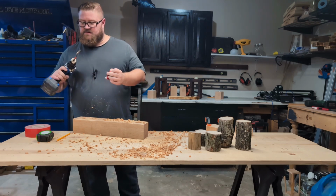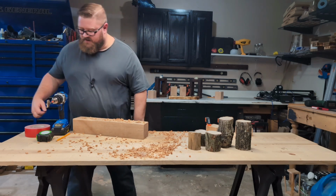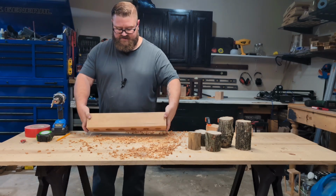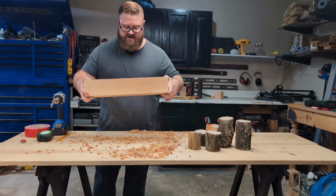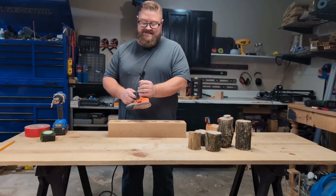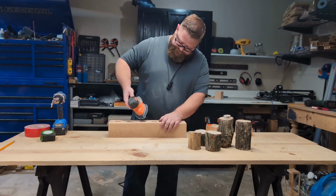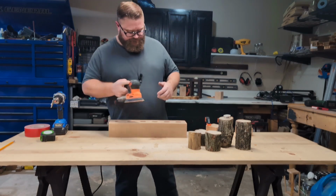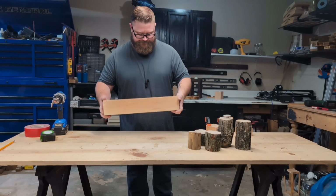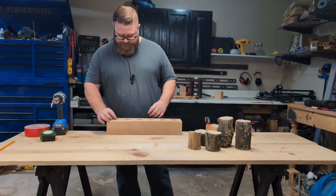You know what? I've used quite a few spade bits. This one's made by Crescent. I think this Crescent spade bit by far did the best cutting. All right, now come through, do a light sand on the top where you drilled all your holes. There we go.